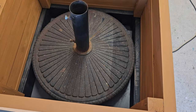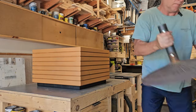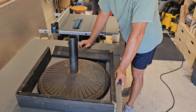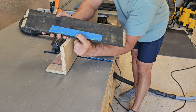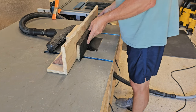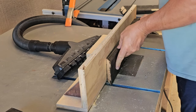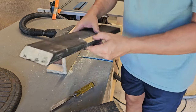I can't believe I did this. I thought I had measured for the base correctly, and I guess I did, but what I didn't do correctly was account for the inside measurement for the base. Now the umbrella stand doesn't fit properly — I am short by about an inch. So I have two options: I could just do away with the black base, or I could notch out the bottom to make room for the base. So I made a mark for the center of the board and then measured out four inches in both directions, and my T-track for my router is roughly in line with the mark, so I'm using that for my stop block. After some cleanup, now the base pieces fit with the umbrella stand.